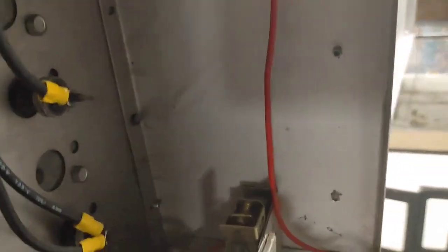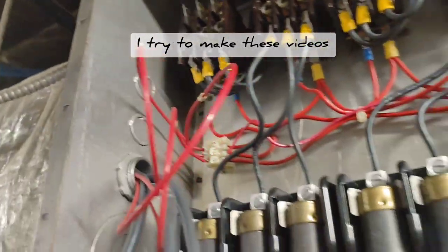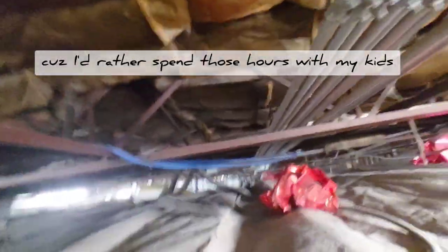We've got pressure switch down there with a high limit right there behind it, and another high limit up on the top, and they're all wired in series to these contactors up there. And this is our incoming 480 power. And then these contactors is what turns it on.